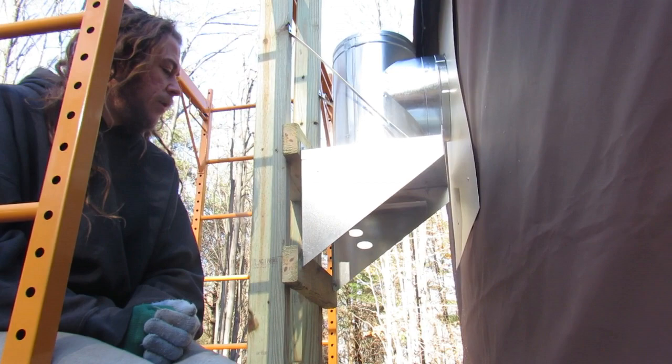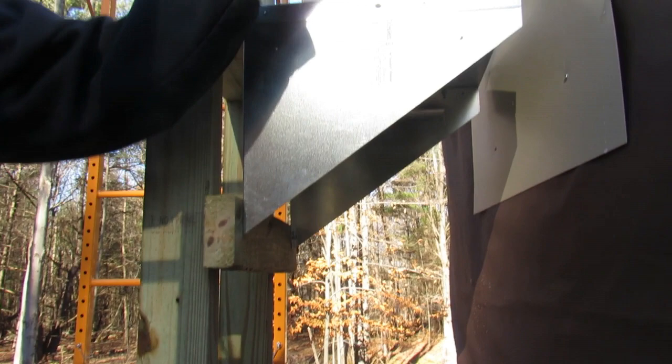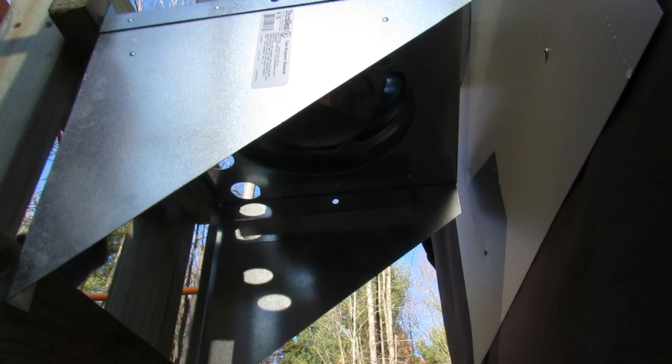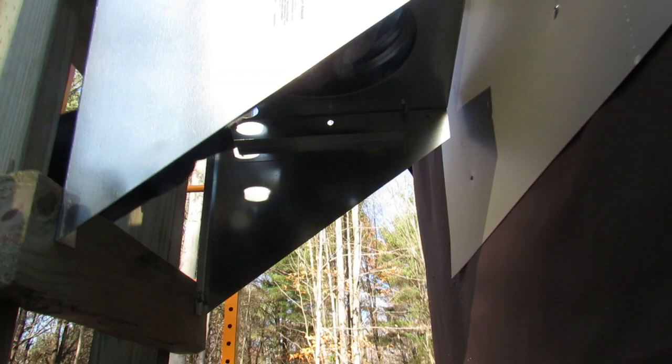Last we left you, we're getting these bolts in for the 2x4s, and we connected our T to our pipe inside, and we also put our platform on to support the T. So we did this by taking a little tiny cap off of the T, putting the platform on, putting the cap back on, and there's two little self-tapping screws that you screw back into it and it'll hold it in place.